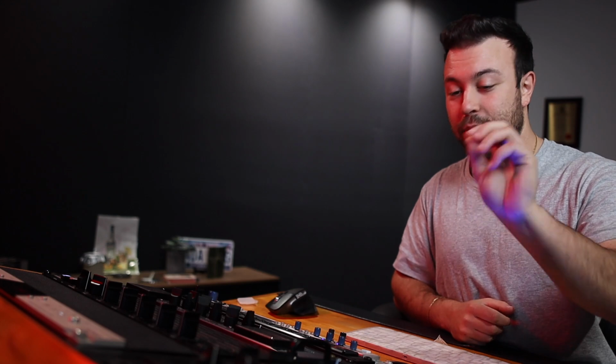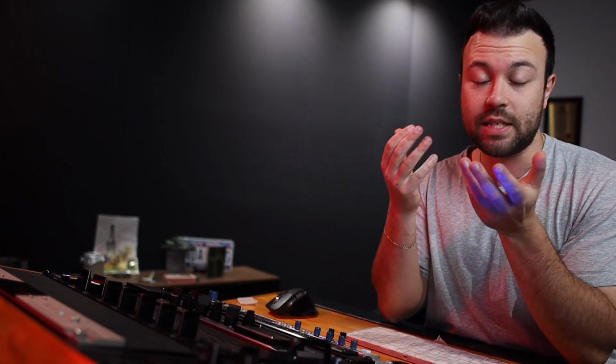Okay, so for demonstration purposes I'm going to jump around the desk and wire my JDK R24, which only has potentiometers in it. It's a dual mono unit I used to use for mixing a long time ago. I'm going to do a 3 o'clock, or 6 decibel, boost at 2 kilohertz on each of the left and right channels. And then in Plugin Doctor, we can plot this in a graph to see how accurately the left and right channels track together. Then we'll do the same with the High Voltage Barry Porter EQ, which I was doing yesterday with James, and it tracks perfectly. Like, the curves look like you're working with a digital FabFilter Pro-Q 3. This matches the left and right perfectly.